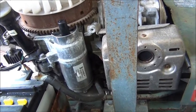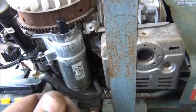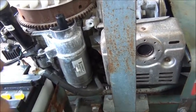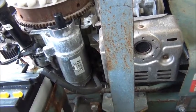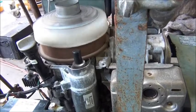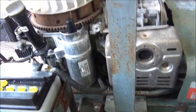The brushes seemed to be a bit - well they're carbon, I shouldn't say bushes, I should say brushes - but the brushes in there were all covered in kind of like a copper coating off the commutator, and for some reason it wasn't contacting too well. I've cleaned all the weird copper stuff off and now it works fine. I think it may have been there originally to help conduct - not sure - but either way it's turning over quite nicely now. No problems at all, I'm very happy with that.